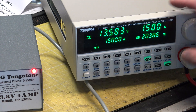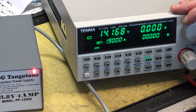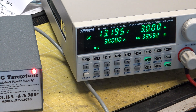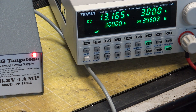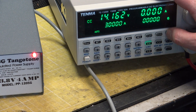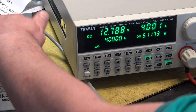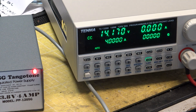Just for argument's sake, let's take it up to three amps. I made it grunt — 13.2 volts. And the fan's kicked in — fan on the test instrument going on. Well, it's four amps — and that's the absolute maximum. 12.8 volts. So it does what it says on our tin. That's absolutely fantastic.